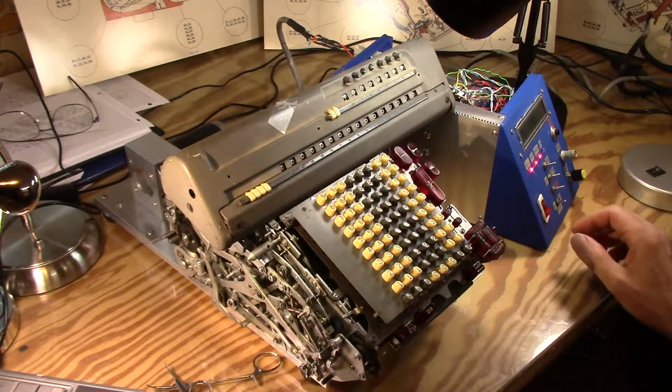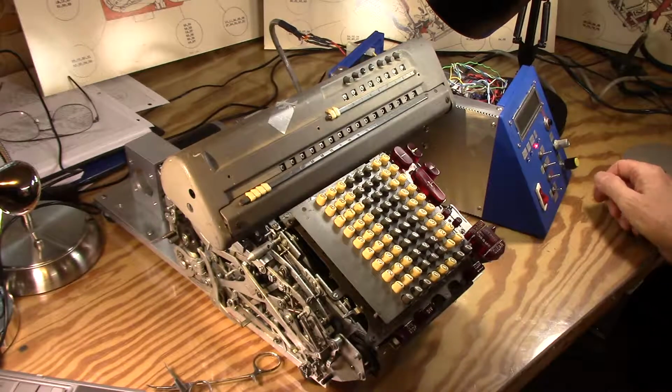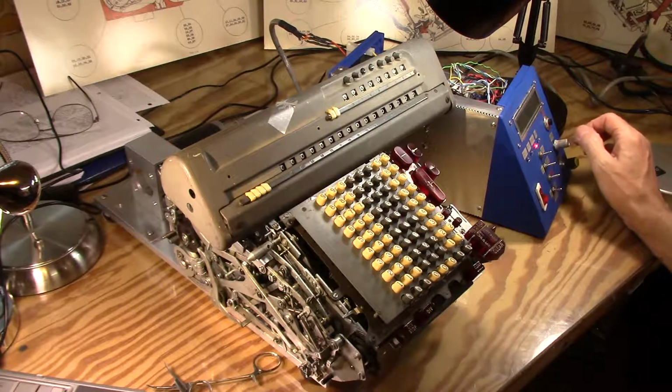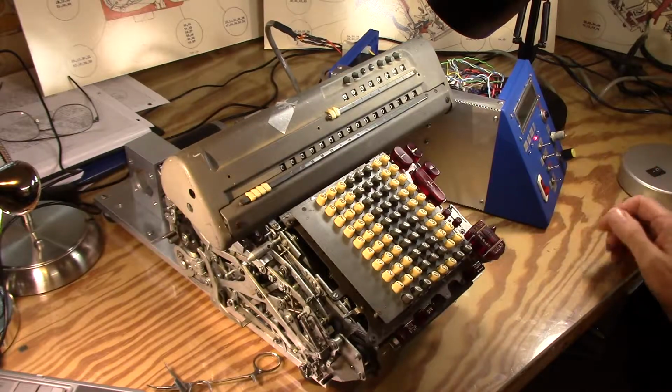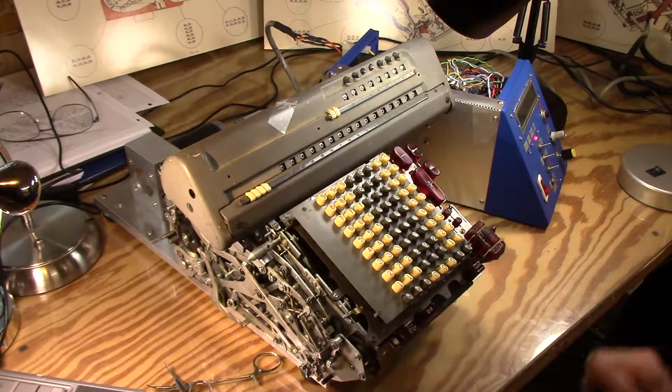Oh, it didn't clear. Okay, it stalled out my stepper motor for just a moment there, and that's because I'm running the stepper at its highest speed possible, and stepper motors lose strength with speed. So I think I'll just dial it down. I'm just going to live with probably a little bit lower speed. I kind of figured this stepper motor would be more than powerful enough.